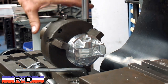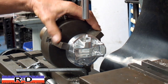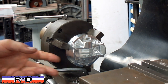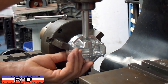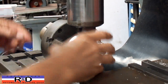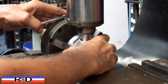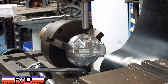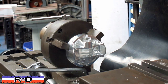I've got a special fixture here to hold the piston — it's a chuck with a set of special jaws, and I made a holding piece for it for the mill. We're going to use a pin that we had to make that's 17 millimeters to bring this down and align the piston. Once we get it lined up, we'll wiggle it back and forth and tighten the piston in the chuck. After pulling the pin out, we'll be concentric to our bore center line.